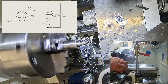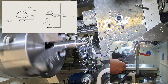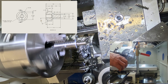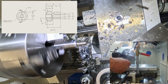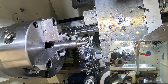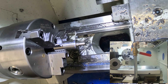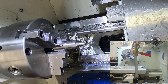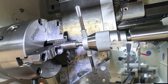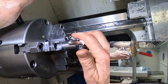With the two diameters turned, I'm now going to use the compound which was set to the angle in the drawing. All I'm going to do is whittle away at that shoulder until the angle meets both the large diameter face and the smaller diameter used to make the thread. This taper does not need to be super accurate — it's really just to provide reinforcement for the bolt, so this is a perfectly easy way of doing it. Then a quick clean-up chamfer, and we're cutting the thread with a die rather than single-pointing it.